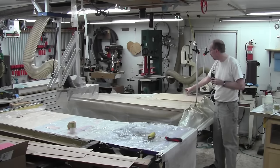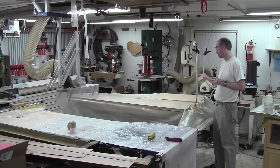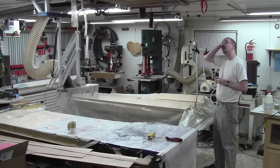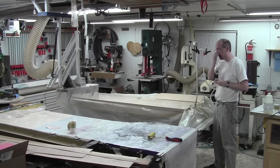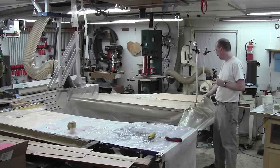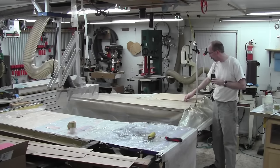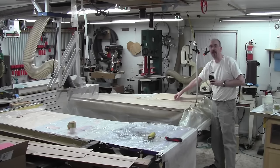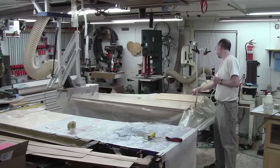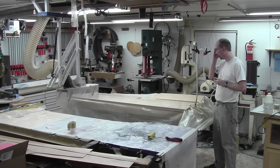It also cracked like crazy here because it's way wider. I wanted the extra room in case the veneer shifted, and I wanted to make sure I had decent coverage. But at the same time, I left an overhang, and by doing both sides, I don't know what the underside looks like at all. It cracked along the outer edge, but that should be okay because the outer edge actually has all that cherry to get a profile. So hopefully all the damage that was done is in areas that are going to get cut away anyhow.